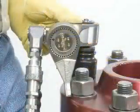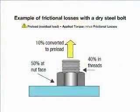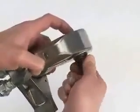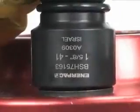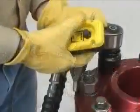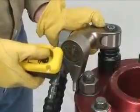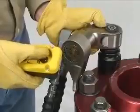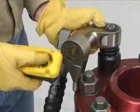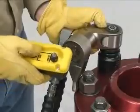Tightening and loosening positions. To tighten a bolt, you may first want to make sure that you are using the proper lubricant to assist in the process. Fit the drive shaft to the tool as shown. Position the socket over the nut you would like to tighten. Position the reaction arm against a suitable reaction point. The reaction point will counteract the force caused by operating the tool. Start the pump, operate the tool to tighten the nut, then stop the pump after the work has been completed.